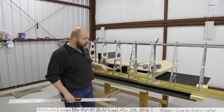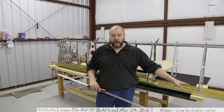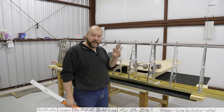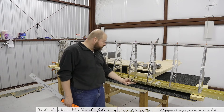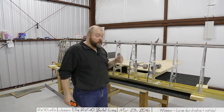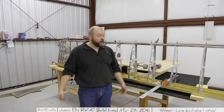To prevent a twist, I've placed a wooden board down at the end so that it is beyond the doubler as far as possible on both top and bottom, with no screws or anything it's sitting on. I've done the same all the way down at the other end, so it's sitting on a piece of uniform length and thickness. The rest is just free in between. Because you've got a stepped doubler that's longer on one side than the other — if you laid it on a table it would be candywampus and actually impart a twist. I've been checking by laying a flat edge and using my trusty level, and sure enough, I have no twist.